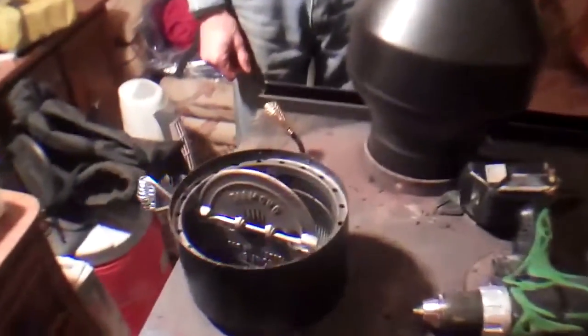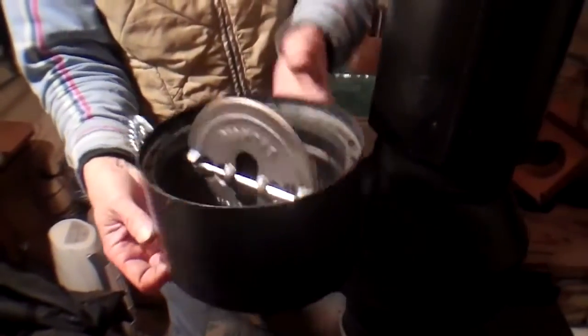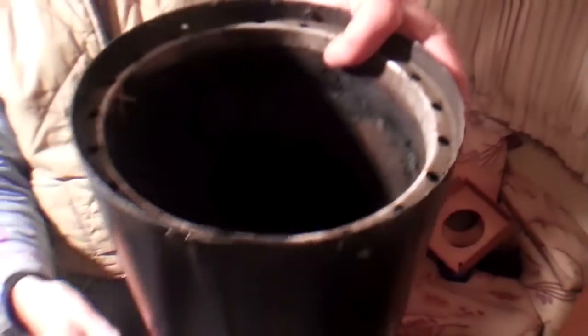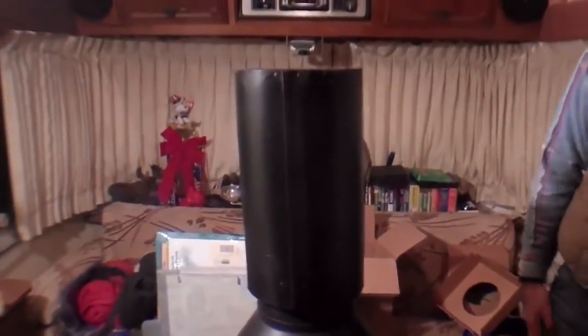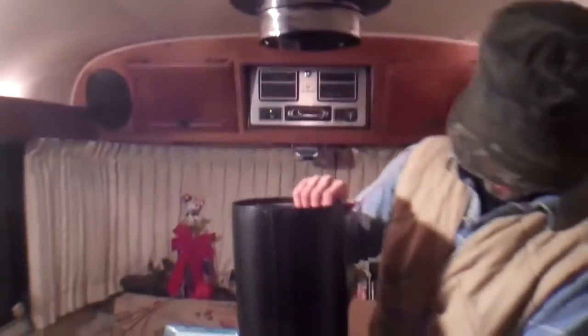The pipe has holes because it's air-cooled — I really like this kind of pipe. It's got a stainless steel inner liner, so if you ever have a chimney fire it won't fail. Cool air comes in at the bottom, travels up through the holes to cool the pipe, and comes out the top. The pipe still stays hotter than single wall, reducing creosote buildup. A lot of people say you lose radiant heat by going double wall — not true. It actually converts that wasted heat to convection through the pipe, and warm air comes out the top via natural convection.